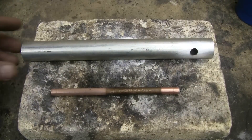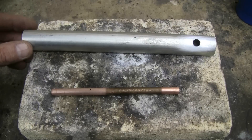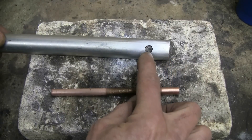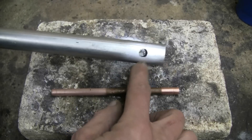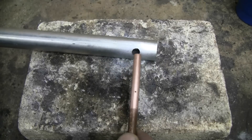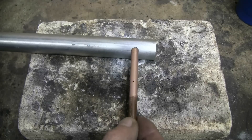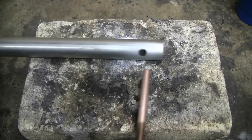The burner is composed of two parts. This first piece is a piece of three-quarter inch steel electrical conduit, eight and a half inches long. One inch from the end, I've drilled a hole through it — you can see the hole goes right through the middle. This hole is sized to fit the copper tubing. You could use three-eighths tubing; this is five-sixteenths that I'm showing here, and you could use quarter-inch as well. Just drill the appropriate sized hole for your chosen tubing, about one inch in from the end on the conduit.